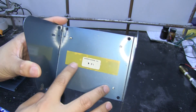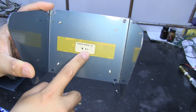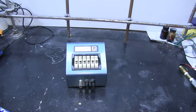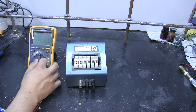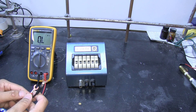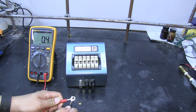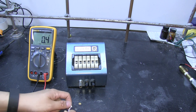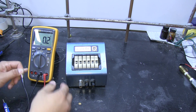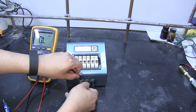Oh, here's something interesting — there's a plate on the bottom here. Ohmite, Skokie, Illinois, 84. I wonder if this was actually manufactured in 1984 — that would be quite a few years ago. Alright, I've got it all reassembled. Time to break out the trusty Fluke. Put it into ohm mode — pretty fast auto-ranging, actually. I have these spade connectors, so there's a tiny bit of resistance in the leads themselves. Looks like it's about 0.4 ohms, 0.3 ohms. If I hold them together tight, it's about 0.3 ohms in the leads, maybe 0.1. Seems like it takes a while to settle in, but let's give this a go.